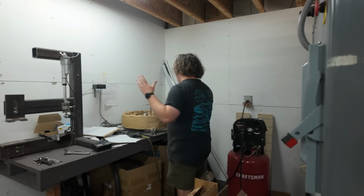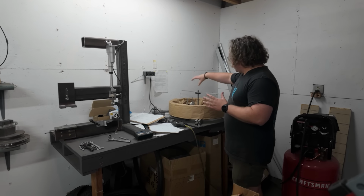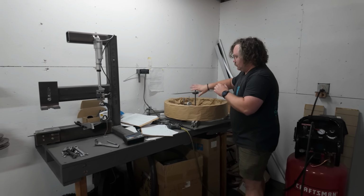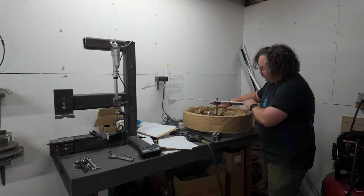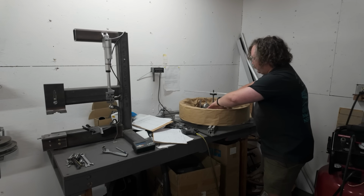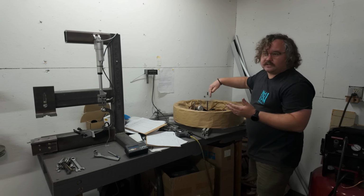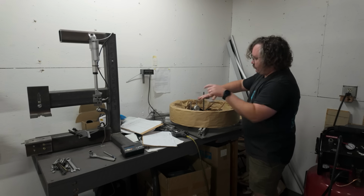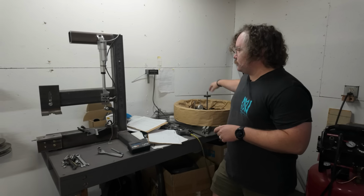Yes. We have a spoke pull through little torture machine where a wheel goes in here, and then this goes down. And this will push the hub down. And until we have some spoke come out, or a lot of the times it doesn't, but this will just keep going until, and we can measure deflection on there and everything. So that is our spoke pull through.